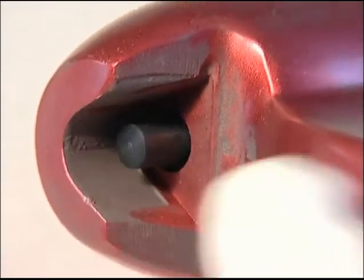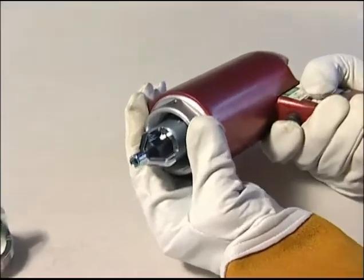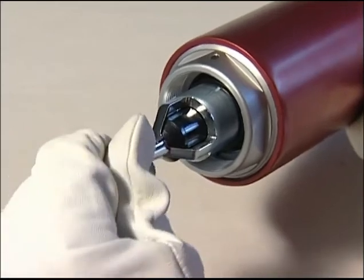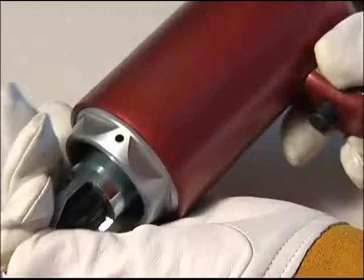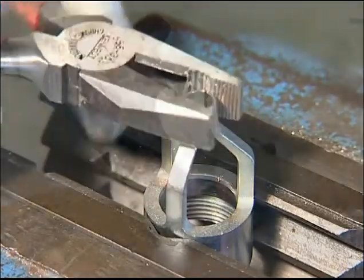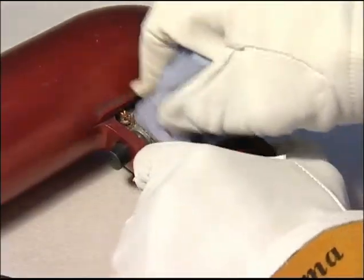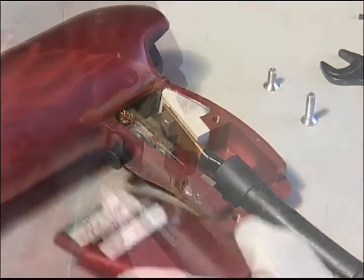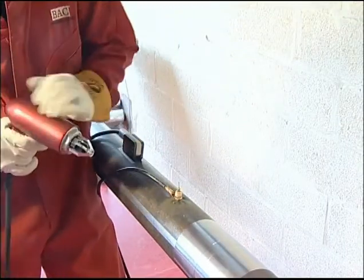Simple repairs and maintenance to the gun would include ensuring pin holder and front piece are securely fastened, and that the pin and ferrule are a tight fit within the jaws of these holders. If they are flared or misshapen, then they must be removed and evenly adjusted either in a vise or chuck. Contacts are cleaned and tightened or replaced when necessary, utilizing the Allen key and open-ended spanner provided in the toolkit. Contact nipple is replaced whenever any resistance is encountered when trying to eject the fused wire. Never force the button.